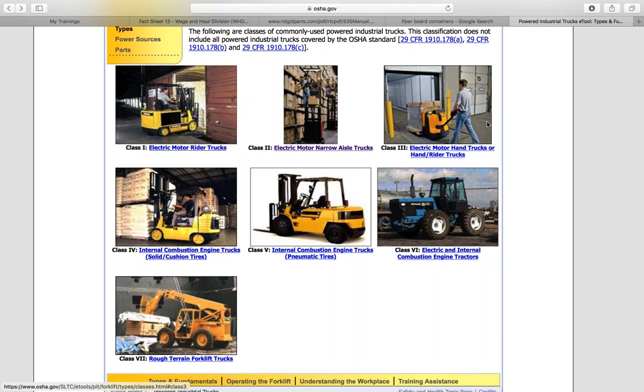And then, of course, pallet jack, right? I'm at the bottom of page 10 going into page 11. Pallet jack, pallet truck, whatever you want to call it. Like we said, some of them are hydraulic, some of them will be manual. In this case, we're talking about more of the manual ones than anything else. We want to inspect that pallet jack before we use it. We want to look carefully for any type of malfunctions, any type of missing parts. We also want to check for oil around the fittings or the hoses of any type of hydraulic power jack, to make sure that any leaks are identified before the jack is put in service, and hopefully take care of it and correct that, right?